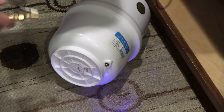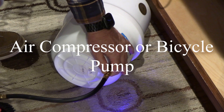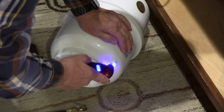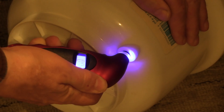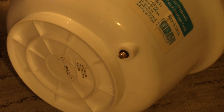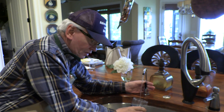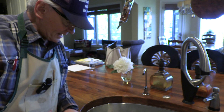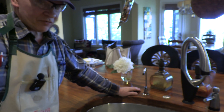So now we're going to fill it. We're at between seven and eight PSI. Now we're at five point eight — pretty close. We're at nine point four, eight point eight. We're going to keep it there — that's good. So I just turned that on and look, already there's huge flow, huge improvement. We'll let this set up for a whole day to refill that tank because RO is a little bit slow. And this is going to dramatically improve our water volume and flow rate.